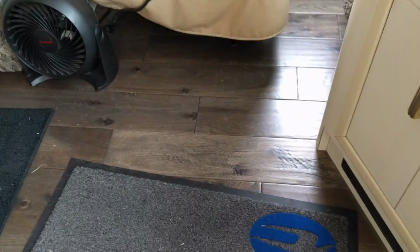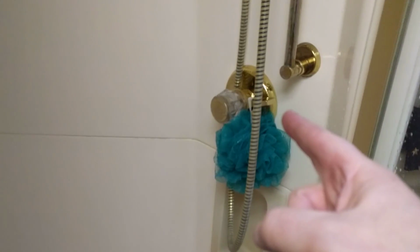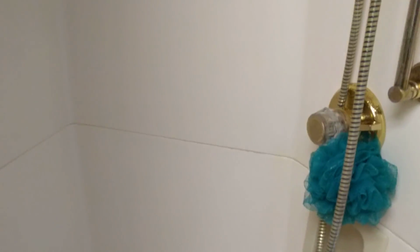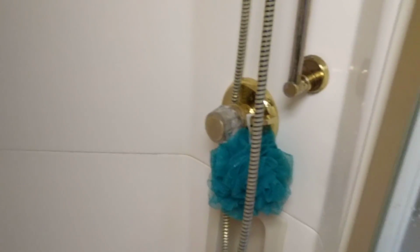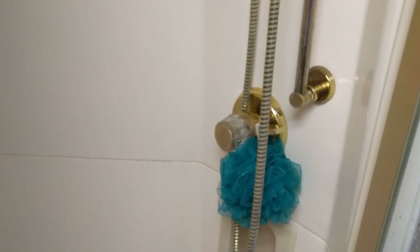because I don't like doing a lot of pressure. But basically what you do, you get air pressure. So I've got 45 pounds of air pressure in the lines right now, and I've already opened all the freshwater drains and let them drain all night with all these open, except I forgot to open this one, so there's probably some water in here. And most of your water will drain out just doing that, but I like to be triple protected, or however you want to say it. So I'll show you.